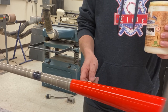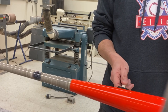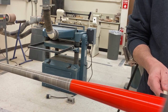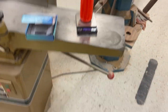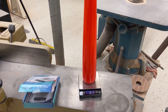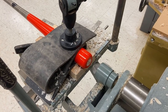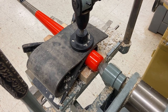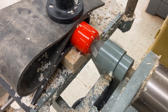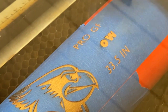For Owen I gave him two bats — one is all black, another has red on it, and I wanted to engrave the Reggie Redbird head in there as well. Once the finish is done I put it back on the scale and check if I have the right shape. I'm down at about 31.1 ounces, so what I need to do is use this horizontal drill bit to cut down to the right weight. Cupping the bat does a few things — it takes weight off, but it also lowers the center of gravity.